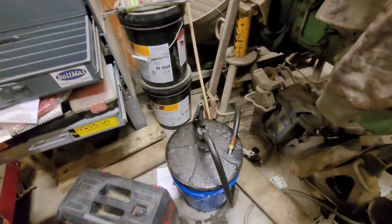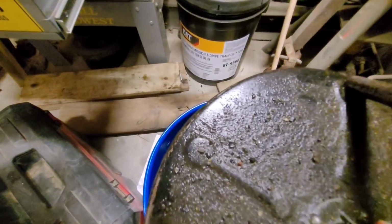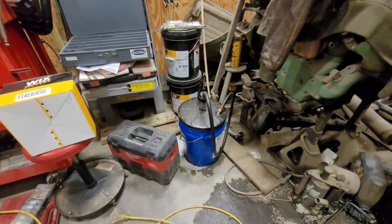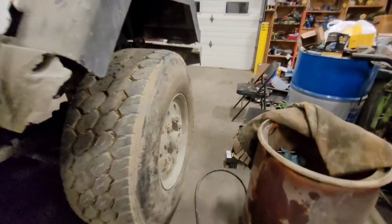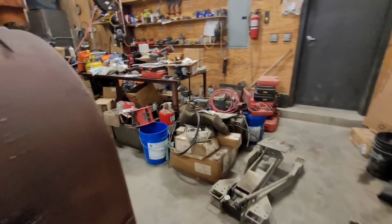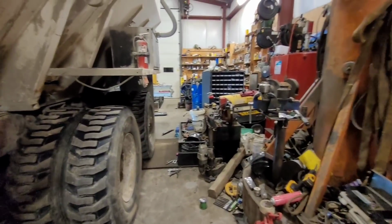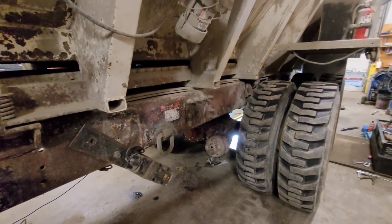So this is why I got away from 5-gallon buckets. Number one, they spill. Number two, somebody comes along to get the lid, puts it on another bucket, leaves that bucket open, doesn't pop a lid back on it, and then comes back to it sometime later. This actually happened. And they put contaminated oil in something. And so a 55-gallon drum is less likely to get contaminated than a 5-gallon bucket. So that's what we try to do, is have 55-gallon drums of the fluids that we use on caddies. So we roll them around. I put 15-foot hoses on them with them Lynx air pumps. But anyway, all right, so that's good.